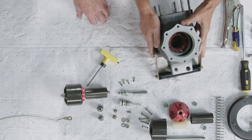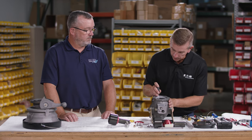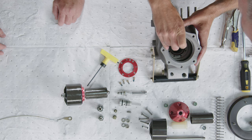With the four screws removed, we're going to remove the seal retainer plates which hold in the Teflon seals. First, there is a small O-ring sitting on top of the seal retainer that must be removed using a fine pick — take extreme care not to dig into the side of the cavity.